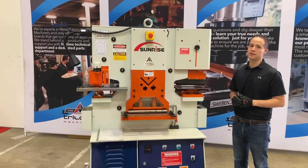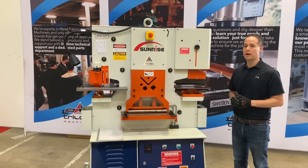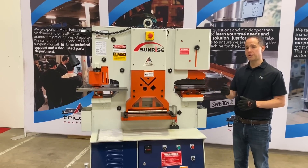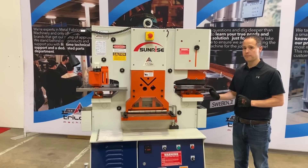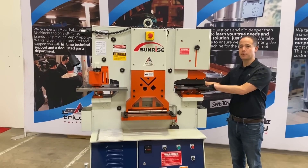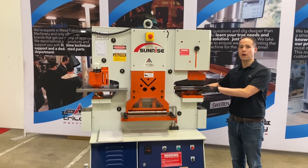This machine features a 66-ton punch, integrated round and square bar and angle shear station, flat bar station with hydraulic hold down for all shearing functions, and an integrated 12-inch press brake. The press brake has a multi-V lower die. You also get a nice table top for resting your pieces as well as a squaring arm.